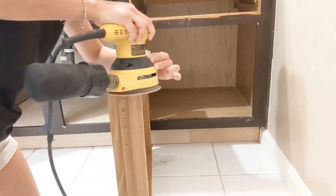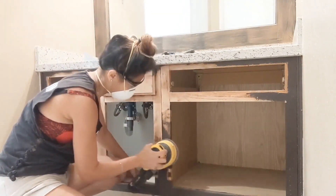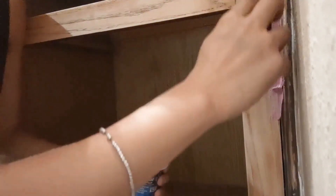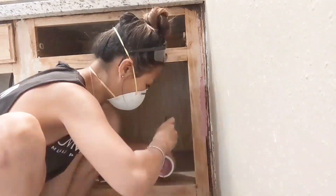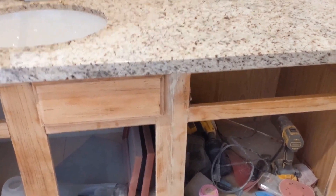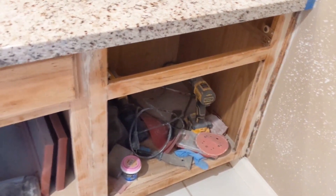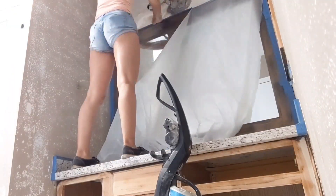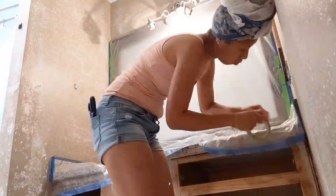You probably don't have to sand down everything — just because our paint built up quite a bit, I decided to just exfoliate certain areas. The next thing I did is use some wood putty to fill out any holes and cracks, to provide the vanity with a little bit of smoother surface before we start painting. I also went a little bit crazy and started buffing the wall too, because it has that texture and I wanted it to look a little bit smoother. This part actually took me the longest.